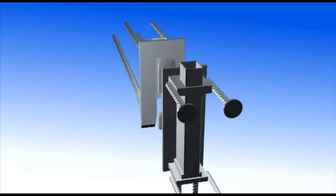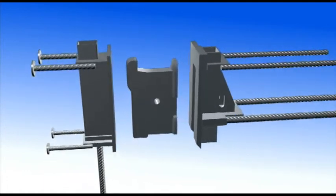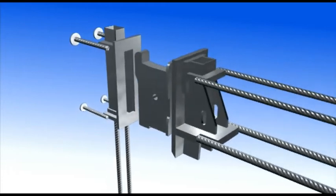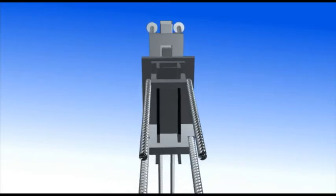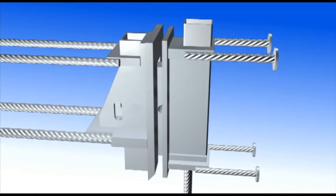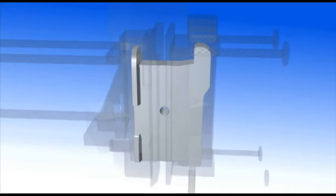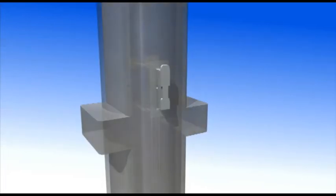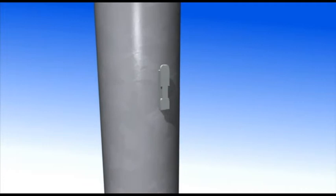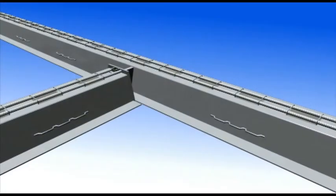The column joints of the A-beam are made using the ANSTAR hidden AEP bracket system. No weldings or bolts are needed for the column to beam joint. The hidden bracket system has no parts protruding from the mold, and the load-carrying support is assembled to the column at the prefab plant. The AEP bracket system suits concrete and steel columns, walls, and beam-to-beam joints.